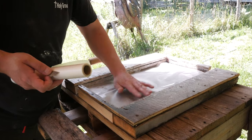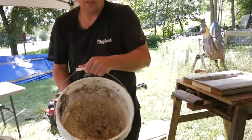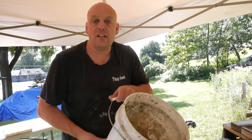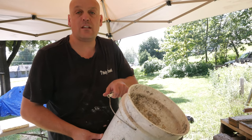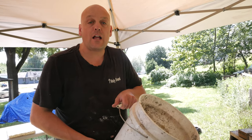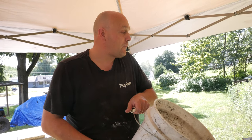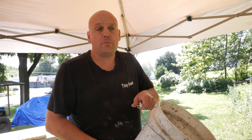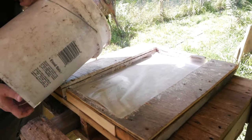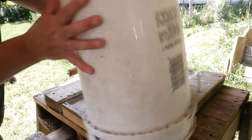That goes in like so, nice and flat. Now the hempcrete is mixed up in my five-gallon bucket — this should be the exact amount we pre-determined and formulated to fit into one tile. We're doing one tile at a time. You wouldn't want to do this one tile at a time for a big project — this is just for demonstration purposes. You'd have a barrel mixer, like a cement drum mixer or a smaller box-store mixer. So it all gets dumped in; make sure we got it all.